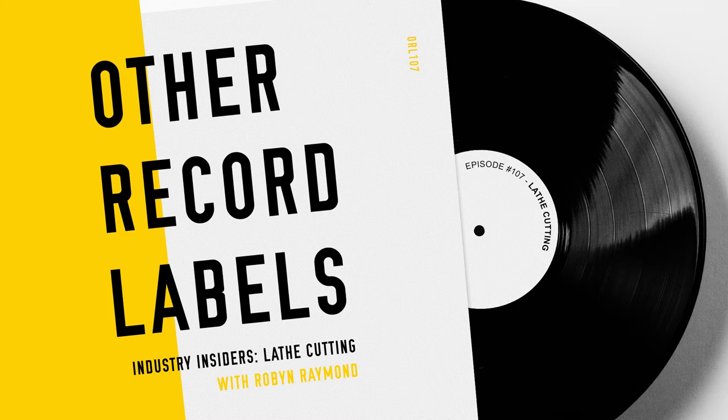Do you have to wait before you do the other side? No — as soon as something's cut, it's good to go, it's final. I listen to it in real time too — there's a two-second delay from the cutting stylus to my playback stylus, so I'm listening to the groove I'm cutting about two seconds after it's been cut. I do that with every single record I make. So if I'm doing 40 copies for you, I have listened to your record at least 40 to 45 times.